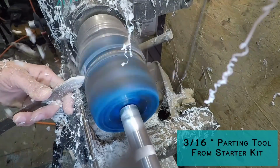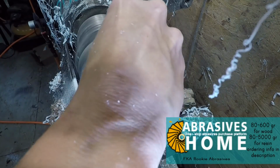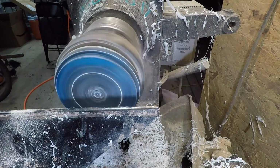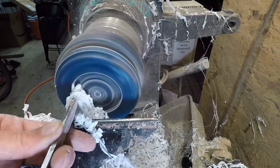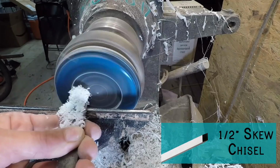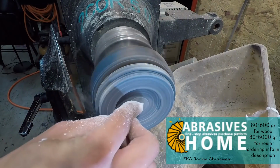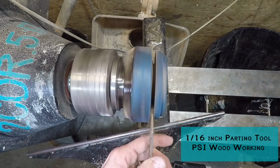It doesn't have to have a pop fit, and the way I get around not having to have that pop fit, and you other turners know what I'm talking about, is by making the inside of the lid, this is number 2 that I think about, the part of the lid that goes inside of the shaving bowl, a little on the weighty side. In other words, I make it a little heavier on purpose, so that it will not just fall out when you pick up the shaving set. The lid kind of stays in there. Even if it's on the loose side, the weight going inside of the piece will help to hold it down and ensure that if you had to make it a little looser because of your resin finish, it will stay. So those are two things. Just keep in mind the resin finish is going to be on both sides, and keep in mind the weightiness of the lid. You want to make sure when they pick it up, it doesn't just fly off.